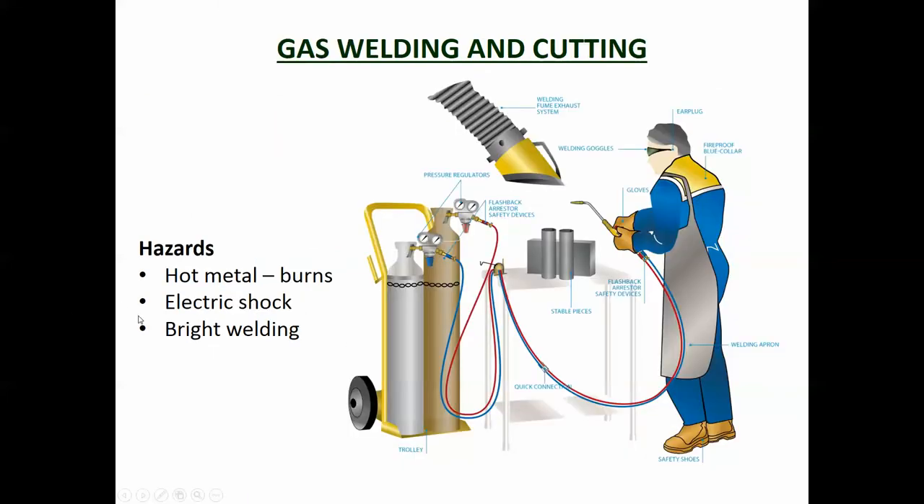So how do we join steel? One way is gas welding. What you're doing is melting a bit of steel - you put the two bits of steel together and melt another piece of filler metal to them. This is oxy-acetylene welding, so the hazards are burning - there's no electric shock because there's no electrical system. One tank is oxygen and one is acetylene, and it does the same as the cutting but in this case it's melting to produce a join.